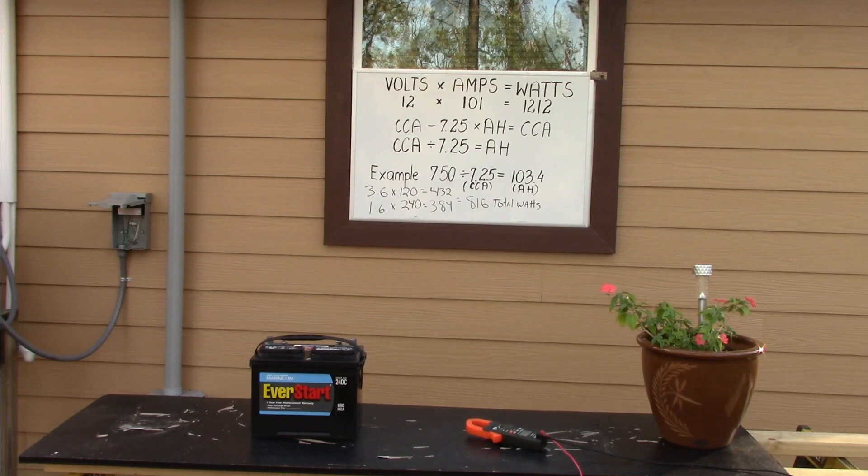That is how you do your load calculations. First figure out your power cells — I'm using lead acid batteries, but there are also lithium and lithium-ion batteries. They get very expensive, but you will get higher efficiency out of lithium-ion. They have more charge-discharge cycles. One important note: you don't want to discharge any battery below 50%. So don't figure that a 1200-watt battery will last you one hour and run it completely down — keep that in mind with your calculations.